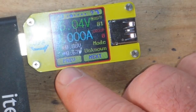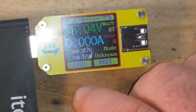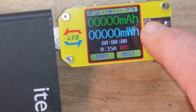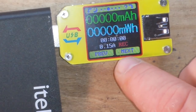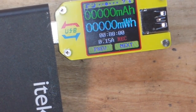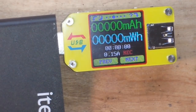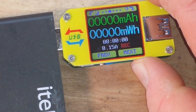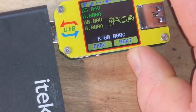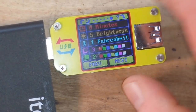We can also look at this and see what the voltages are on the other two USB pins, which is pretty nice. We can come over here and get milliamp hours and milliwatt hours. You can see where it says 150 milliamps — that'll allow us to set a point where this will turn on, and that record will go from red to green and measure the discharge current and power. This will also test cables for resistance, and then we have a nice graph and a little bit of settings.